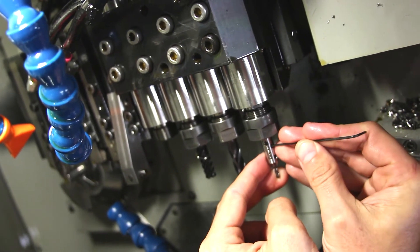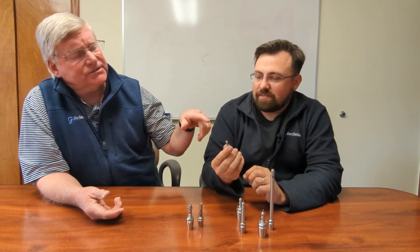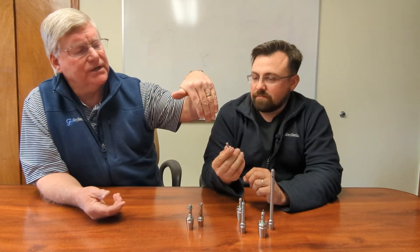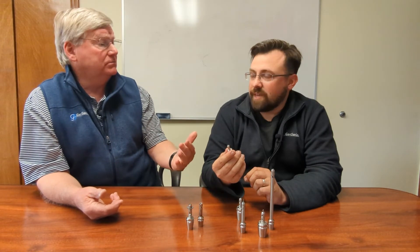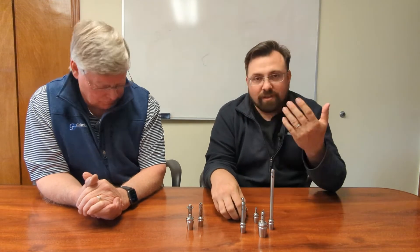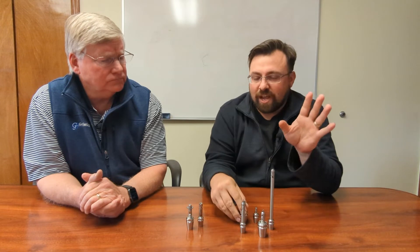That way you don't have to get a big wrench into the machine up against your live tool, up against the precision fragile tooling in your rotary positions. This has an adjustable positive stop on the inside where the shank of the tool goes down into. The ID is a very tight tolerance, so the fit of the shank is going to be very stable. You have to fit a nominal shank size — eighth-inch shank, three-millimeter shank — and depending on the ER taper, we go up to as large as quarter-inch in a couple of cases. Where these really shine is any time you've got to work with anything that's an eighth inch or smaller.